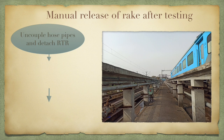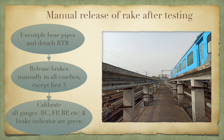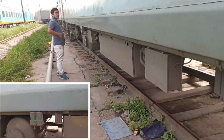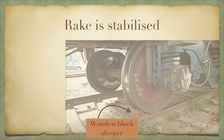Now we move on to the final part of air brake testing. The pipes are detached from the rig and brake is supplied to the whole rake. The brake is then released in all coaches manually except the first three coaches — make sure the first three coaches are not released. This is done to avoid the rake moving under the gradient of the pit line. The brake is manually released and the brake indicators confirm the status. For added safety, wooden block sleepers are also applied to the front three coaches to prevent their movement under the gradient.